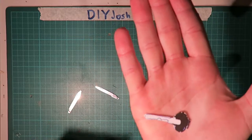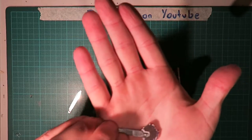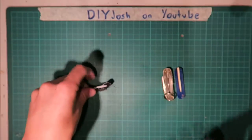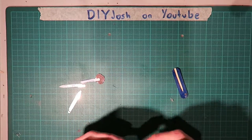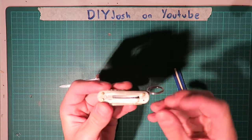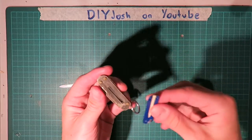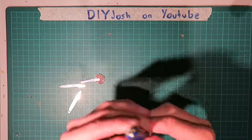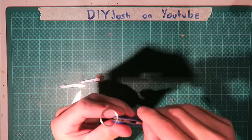Once you've got that, you take this to the bench grinder and grind away all of that black stuff. And then drill a small hole where the hole needs to go. Once you have that, you basically just insert it in, put the brass pin through, and that's it. You just put the thing back together, which is fairly simple — they just pop together, these little scales. And there you have it.